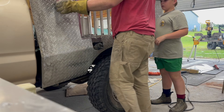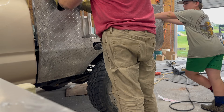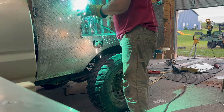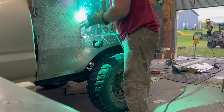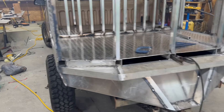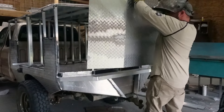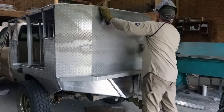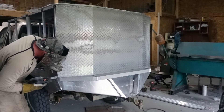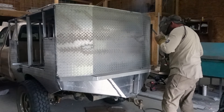We put it up in there. I got a cut out for the gas cap there. We'll put it on the side of the truck, get it held where it goes, and then tack this to hold it in place. Just for some of you keyboard warriors — I do have a fire blanket covering up the inside of that gas cap, just not the outside. Here are the side pieces, both sides. On the back, I just put it in the metal brake, took my measurements, broke it where it goes so it fits nice and snug around the edge of the frame. Get it put right in place, tack it up. I'm just showing you guys the fitment — that should be enough to help you get going.